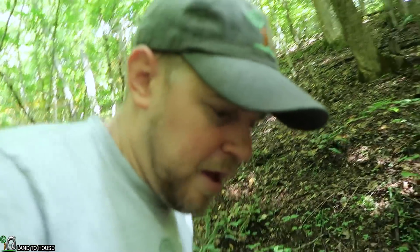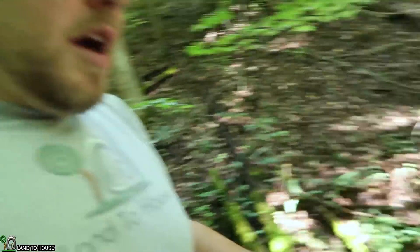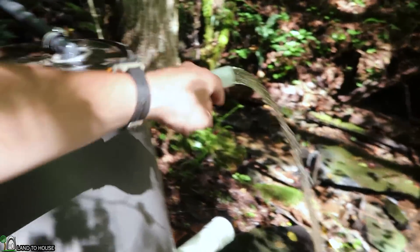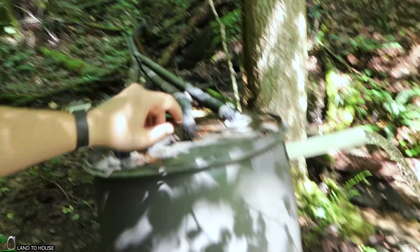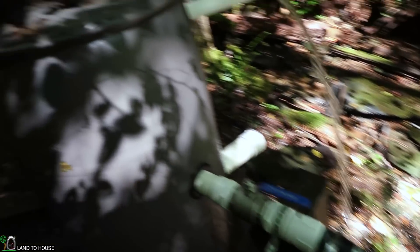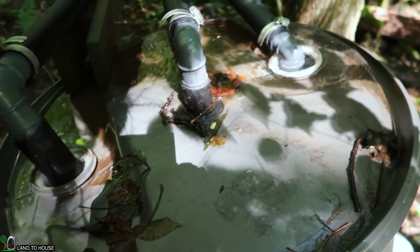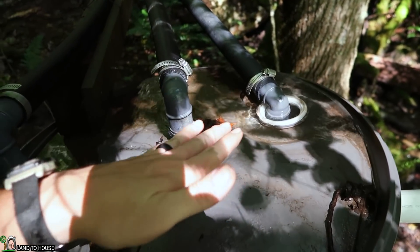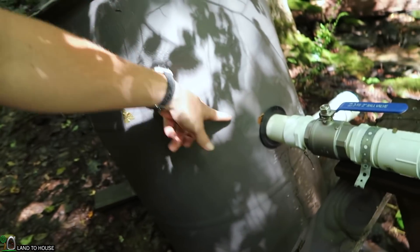Let's head down here to the barrel intake and see how much silt has built up in the bottom. I still have quite a bit of overflow, which is nice — it's full there and full here. People were concerned that air bubbles from up top were going to be entering into the penstock. As you can see, the bubbles are coming out right here but that's all they're doing. They go in and then just bubble right back out, so there's basically no way those bubbles are going to be getting down into this much water.